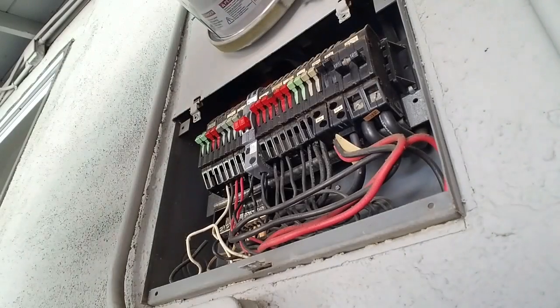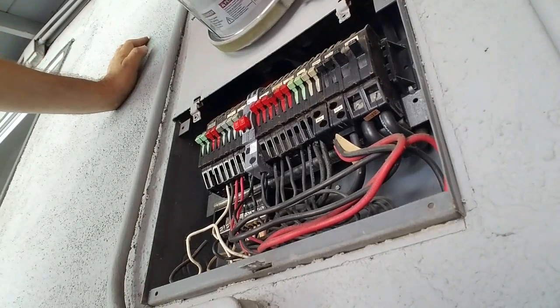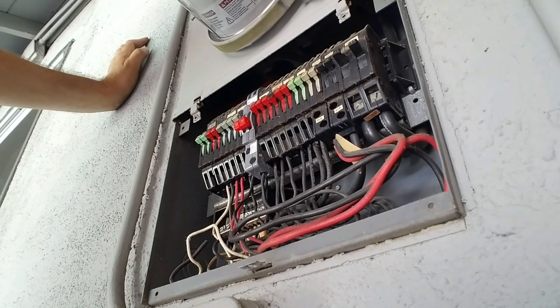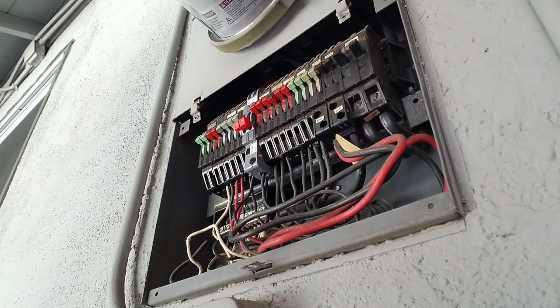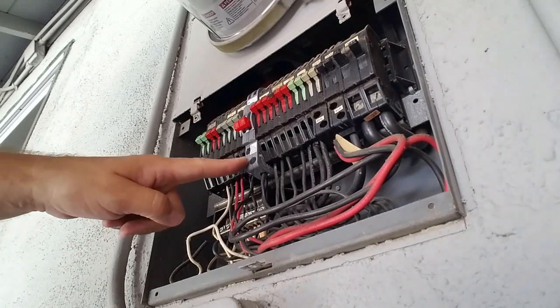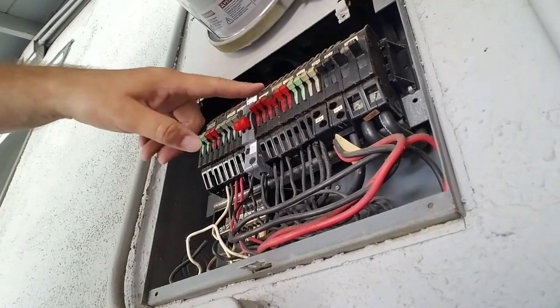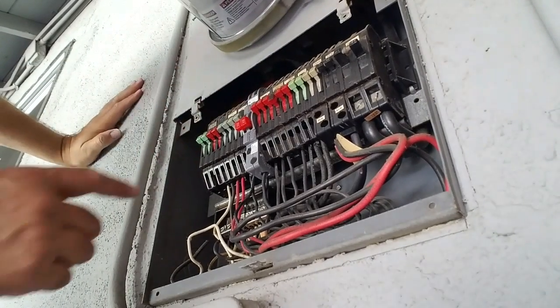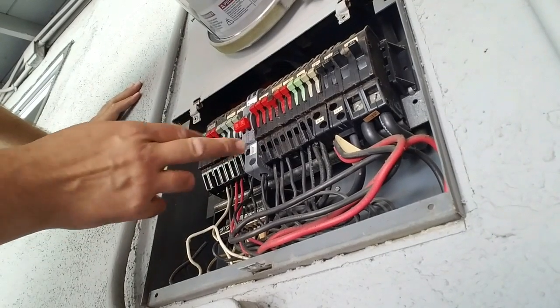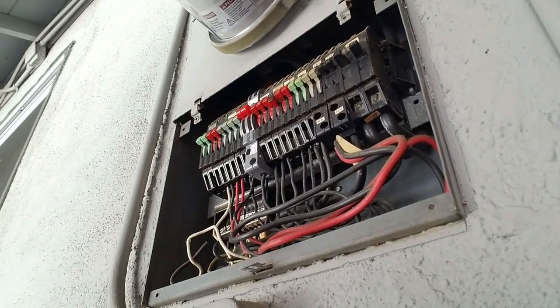That's about it. I'm going to turn it on. No one's home right now so I'm going to turn on the main. I just heard a pump turn on — there's fans — you'll hear a few things turn on when you turn the main on. If someone was here at the house, I would have them turn off all their TVs and electronics, just to reduce the load when we turn the main back on. The problem circuit is here — I left those two off. This one looks like a spare, we'll leave that off. That's a bad breaker right there, but it's not being used. I'm going to turn the two circuits on for the breaker I just installed. That should be it — we're going to test it.